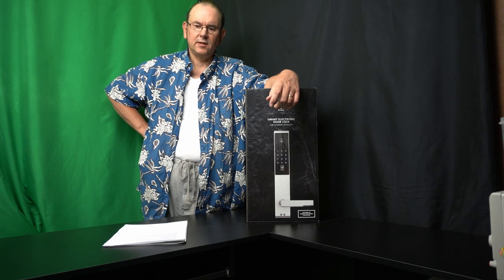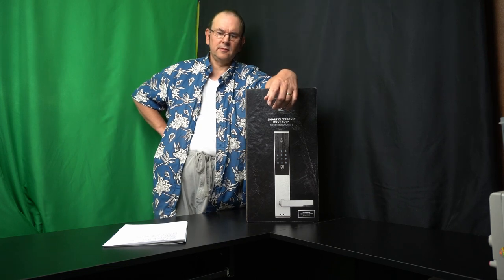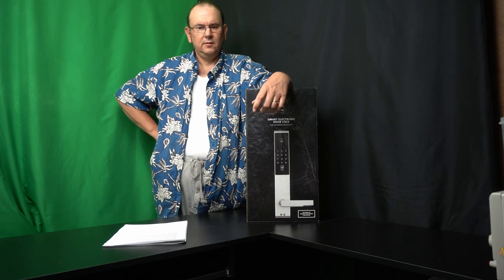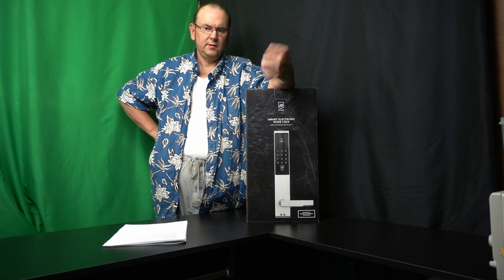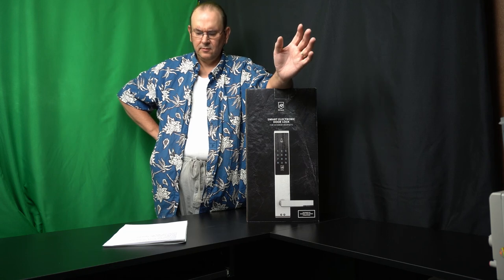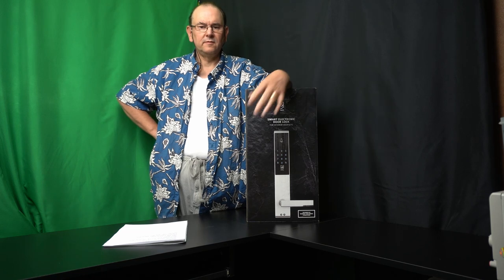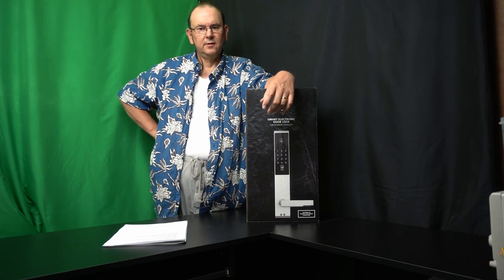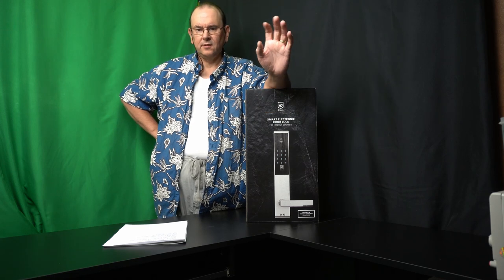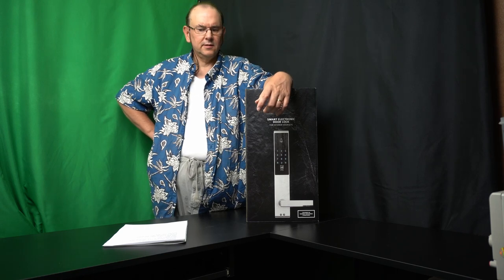this is just a feeling thing, but I swapped out the batteries to new batteries. The ones that came in the package were installed, but I took new batteries and put them in. The device seemed to wake up a bit more. The display worked better. The sound of the mechanics sounded better. But anyway, the key to getting the mechanics to work, as they warned in the manual, is that this device will not work if you don't specify if you have a right or left sided door, if you haven't done that definition correctly. So what I did is I went into the unit and defined that, and then it actually started to unlock and lock itself as intended.